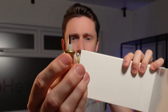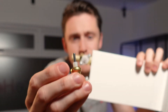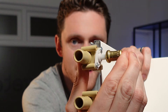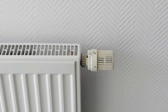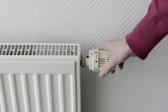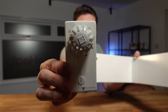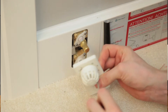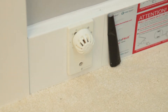One thing to note: make sure you look after this little white collar, because that white collar is what allows you to completely isolate it. As the room heats up, the wax in the bulb expands and that pushes the pin into the valve, which shuts it off. The knob on the side of the radiator is called a TRV — thermostatic radiator valve — and the thermoskirt equivalent looks like this. Over the front of this connection we have a stainless steel cover plate.